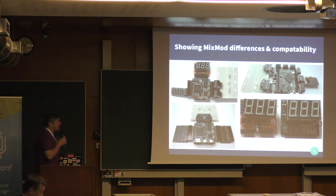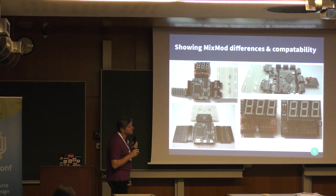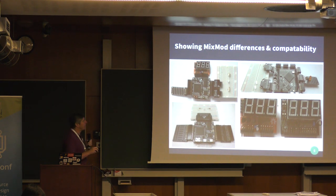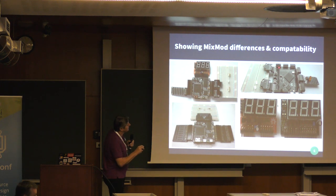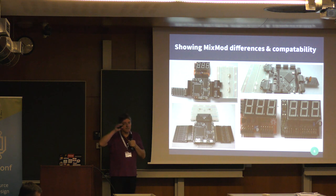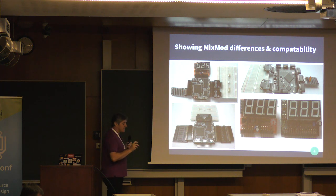Let me briefly review the differences. On the original Black Ice 2, these are just simple PMODs — the smallest ones, which are four-bit: four GPIOs and two power pins. On the right and top, these are double PMODs with two layers, duplicated one on top of the other, giving you eight pins and four power pins, two of which are duplicated — 3V and 0V.